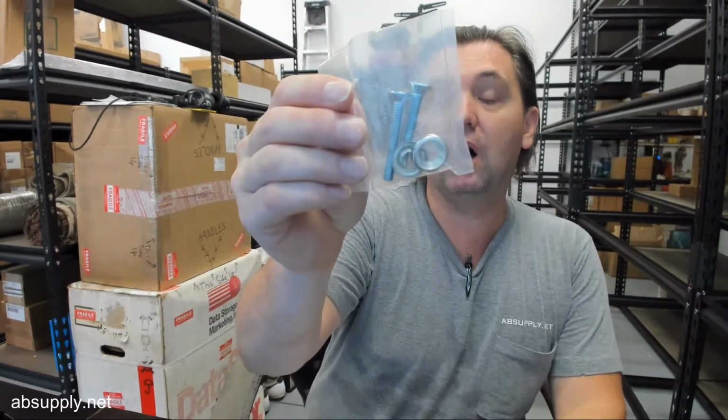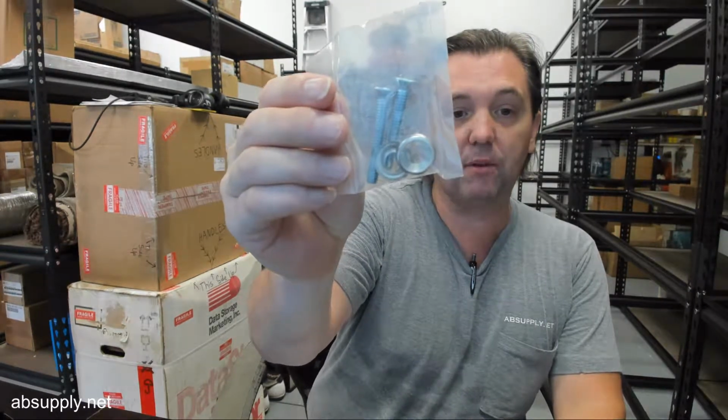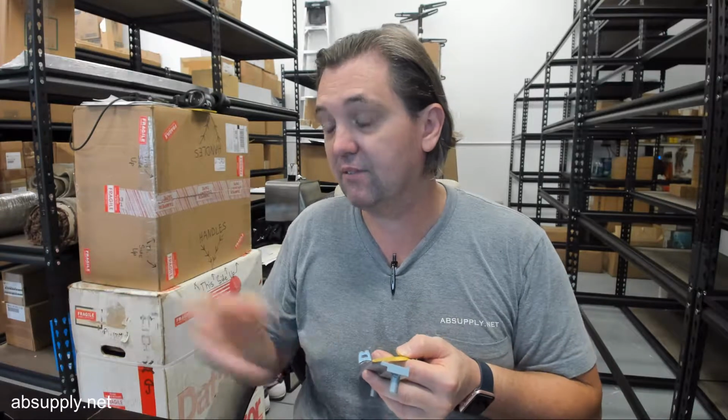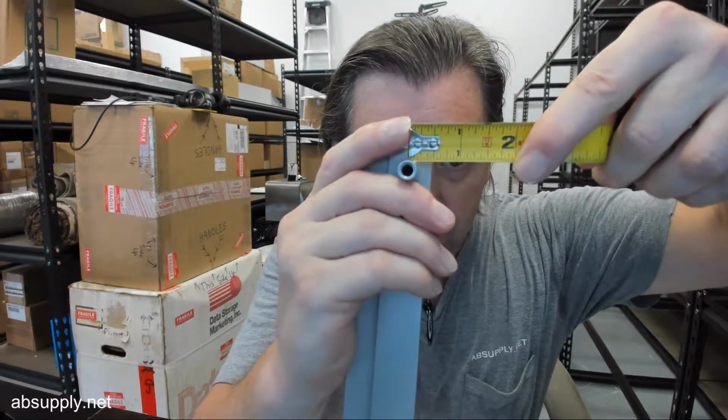Through bolted, going to come with a couple of 1/4-20 flathead machine bolts. Going to come with a couple of countersunk washers. Those are going to go through your door, obviously. It would be important to take notice of the dimension on the template that calls out the .438, the 7/16 of an inch, here to the edge of the plate.